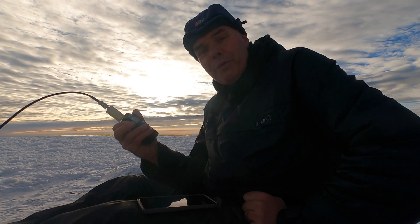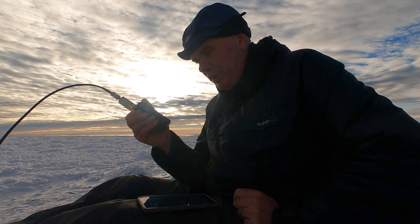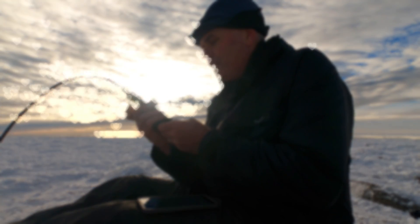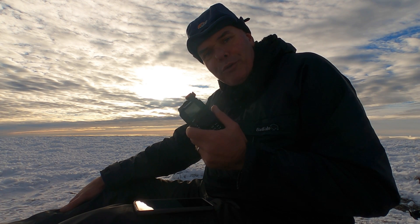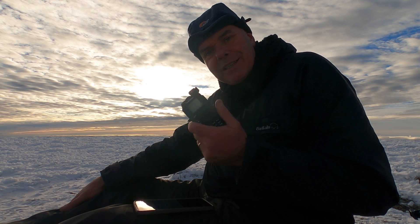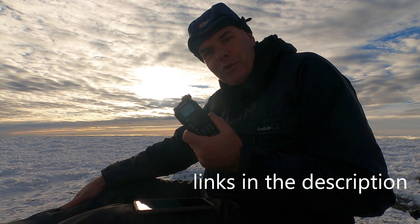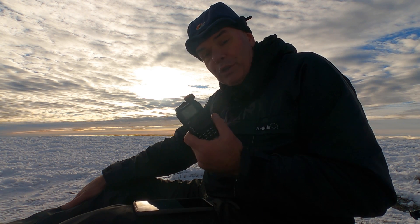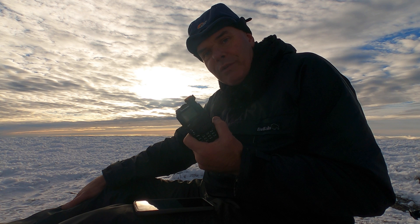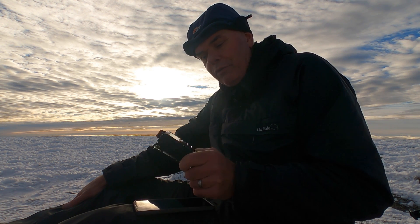Well there we go — I've qualified the summit on 2 metres with 4 contacts, and got a summit-to-summit in there as well. And that was without even spotting myself. Because these radios are so cheap and so good, there's actually an entire community sprung up around creating exciting and different firmware for them. You can actually open these up to receive from HF right through to microwaves. Do not try to transmit on anything other than 2 metres and 70 centimetres because the filtering isn't there for the other bands. But it just shows what can be done with a chip and software defined radio. There's loads of good firmware available and you can do all sorts of stuff with them.